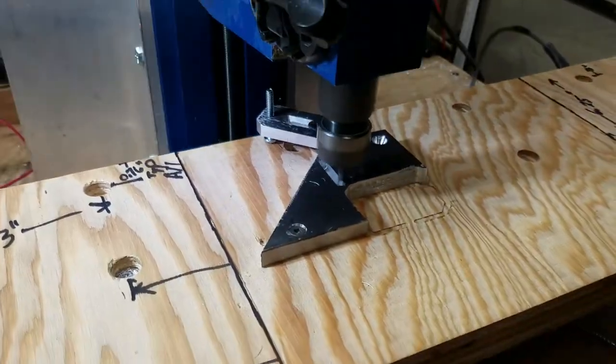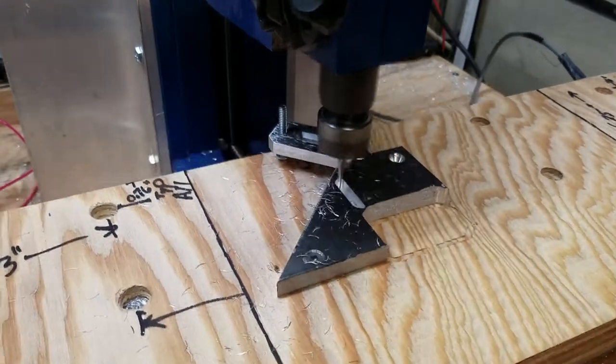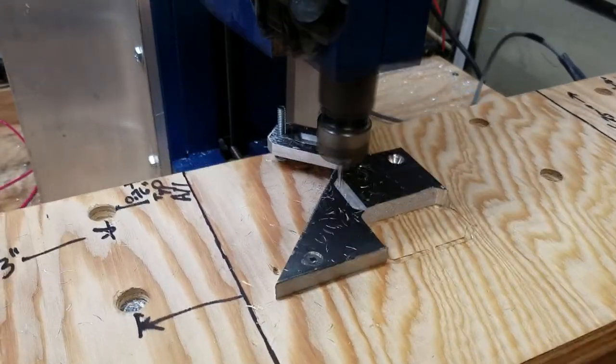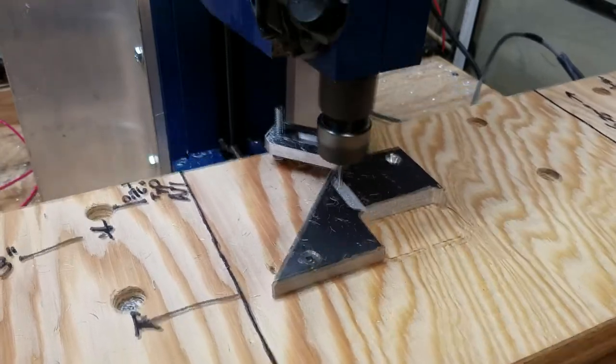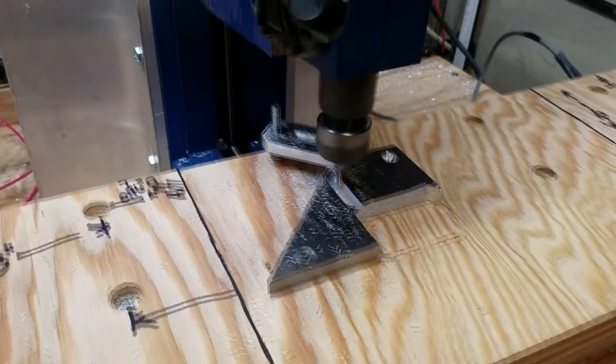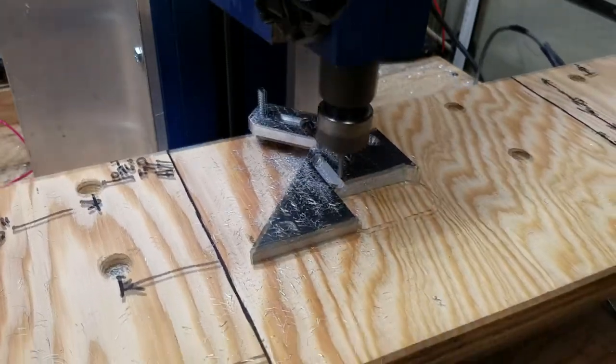Yeah, so here's a way of bootstrapping your way into some clamps, a cheap clamping method, and it lets you use these really weird-looking scraps that you might not be able to use with a regular jaw. And at least this method we've proven thus far has the holding power for aluminum work with an 1/8-inch bit.